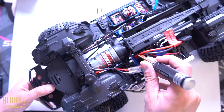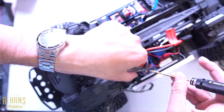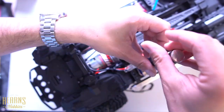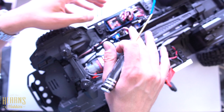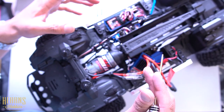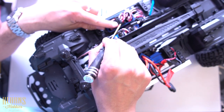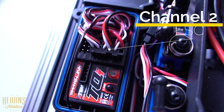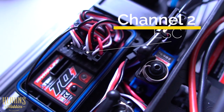We've opened the receiver box and now we're going to find the ESC wires. To do so we need to get some movement, so we'll remove the speed controller here. Generally speaking, the second channel is for the speed controller, so let's remove channel two. In this receiver you have channel one, and channel two should be the third one up here — so carefully just lift this one out.